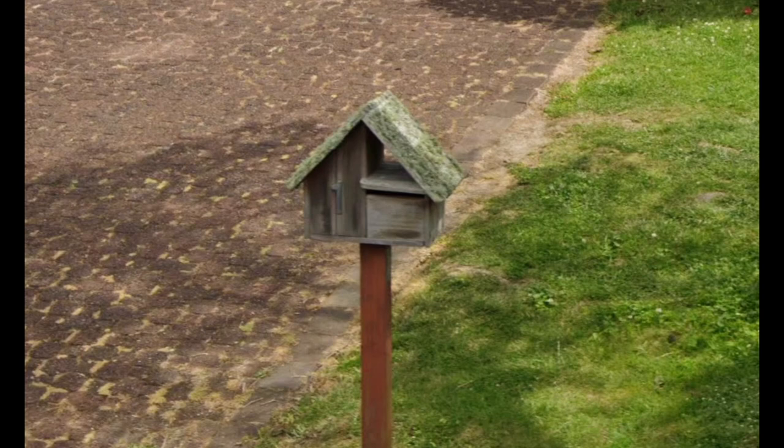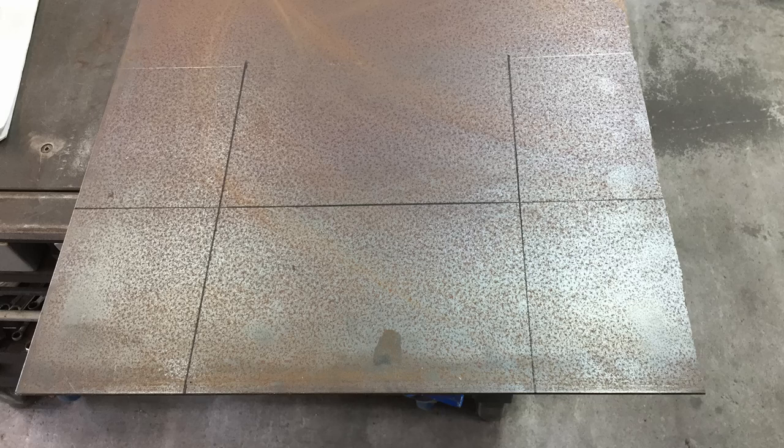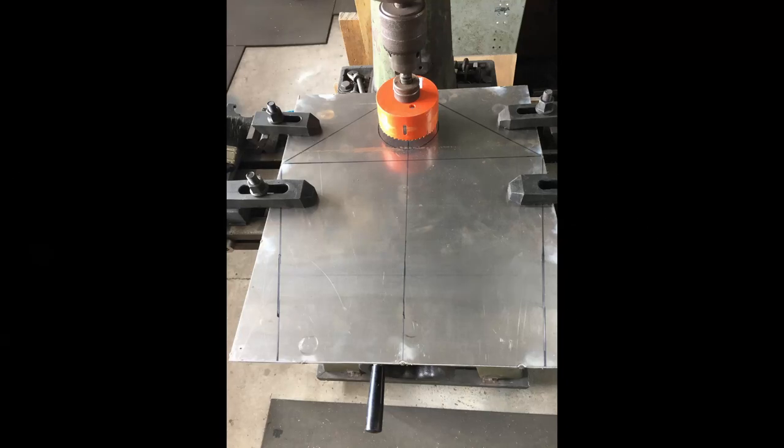Anyway, it was around about August 2021 when I started making the letterbox so I could give it to him for his birthday in October. I wanted to make it like his current letterbox with a house style, you know, a pitched roof on top. What I had in stock was three millimetre steel plate — that's around about an eighth of an inch — which is kind of thick for a letterbox. I drew the design up, got two pieces of steel, and tack welded them together because I needed one piece for the front and one for the back. I cut a hole in the top for where the newspaper goes in and put a bit of plastic stormwater pipe in there to hold the rolled-up newspapers.